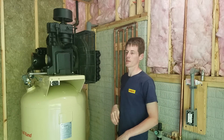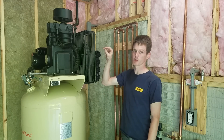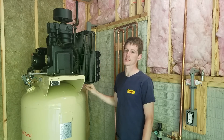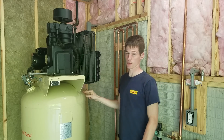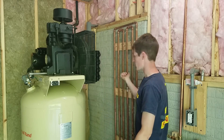That's everything I have on my air dryer setup. If I only had to choose one of these to do, without question I would do the after cooler. The reason being, I'm getting the moisture out of the air before it goes into the tank, so my tank would last a much longer period of time. Also, it's removing far more moisture than what this cooling coil is.